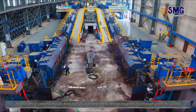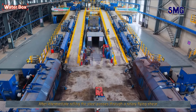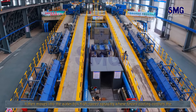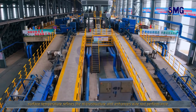As the aerial camera moves forward, you can see the billet rapidly passing through each mill stand. After intermediate rolling, the steel passes through a rotary flying shear before entering the pre-finishing mill for further reduction. It then moves into the water box high-speed section, where forced cooling controls the surface temperature, refines the microstructure, and enhances wire rod performance.